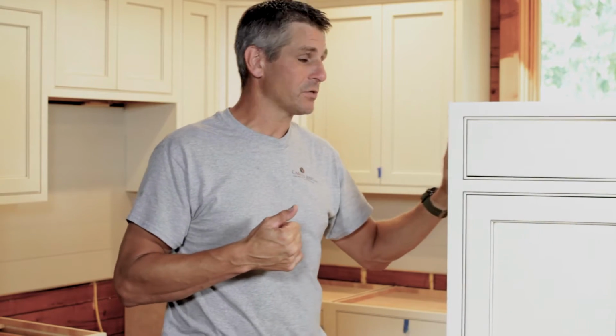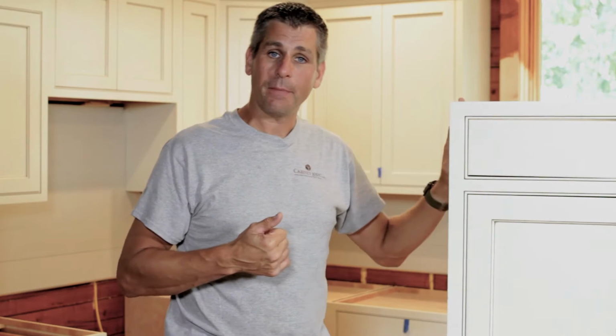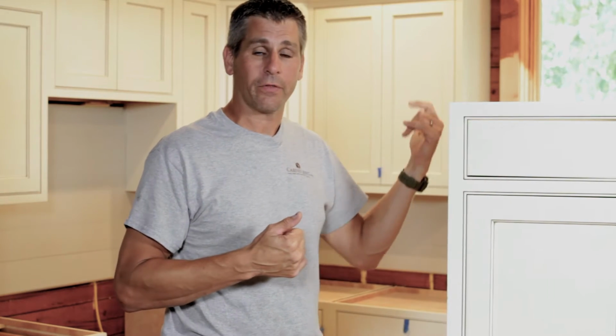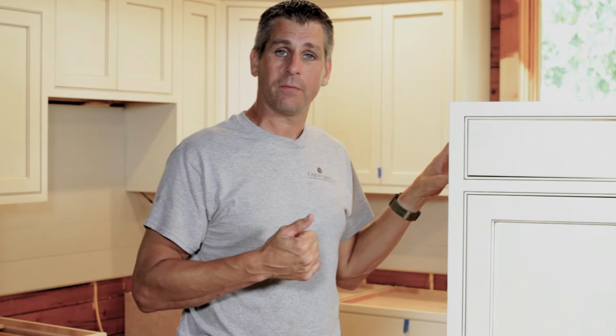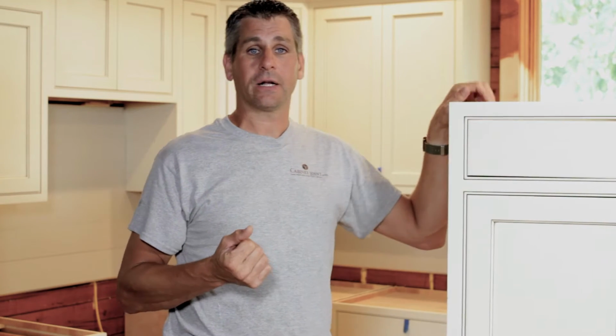So this is just going to come as a raw wood veneer with the front frame hanging past by 1/4 of an inch. It's not meant to be seen. It's going against a wall or another cabinet, so why have Conestoga spend more money on your behalf, which comes out of your wallet, to finish a side you're not going to see?